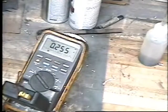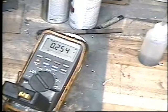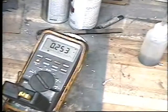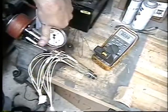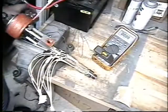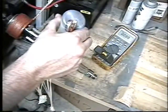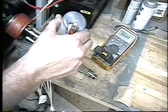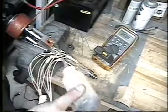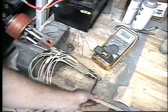We're down to about 250. Once it gets below 212, we'll open it up again and put some more water in it, reload it, and shoot it off again. We're going to add the water in manually — there's no pump or check valves or any mechanism to get water into the injector. Pretty much the amount of water going into it determines its capacity. I'd say it holds about an ounce of water, maybe 2 ounces. This is distilled water, by the way, with absolutely no solids whatsoever.